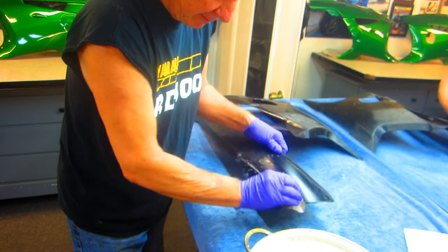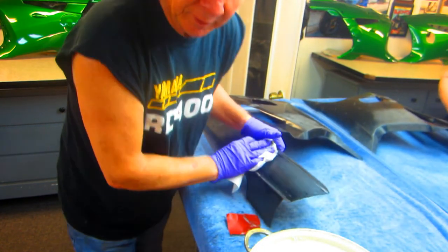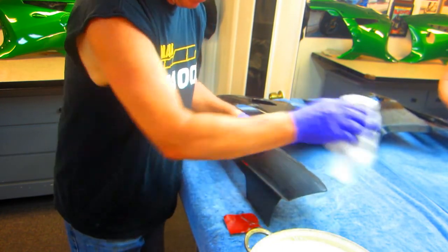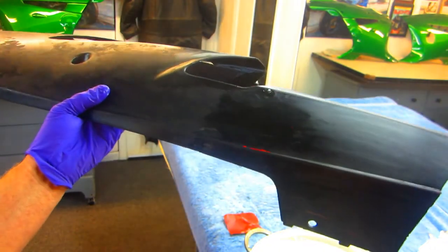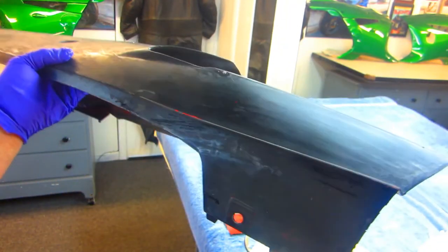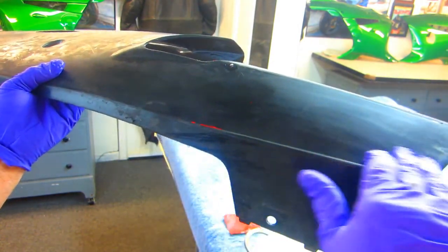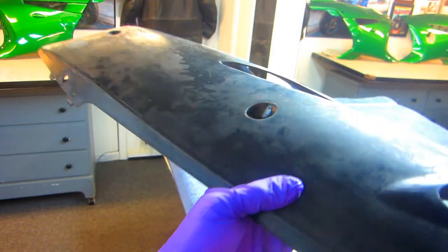This is not the kind of thing where you can hide your mistakes with flat black — the reality is when they paint something flat black, they're usually hiding something. The objective is to do the whole part; it's going to be very labor-intensive. We're just going to grind away at this for the next couple of hours. It's got to be smooth. Seems like 600, maybe 400 if it gets really rough in some spots, but no rougher than that.